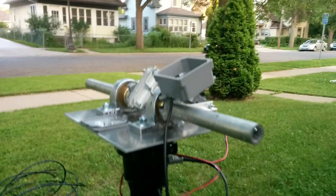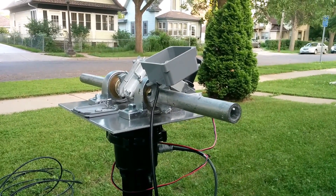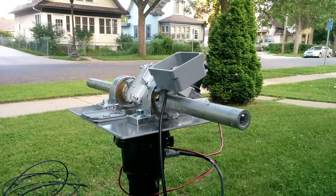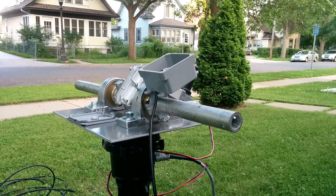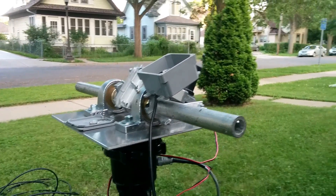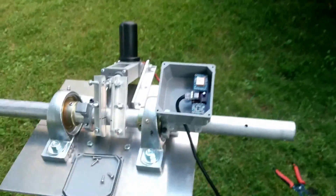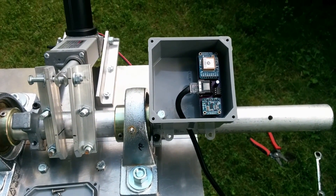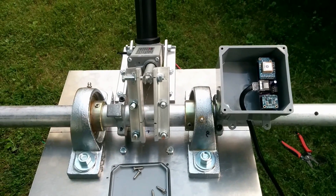It may be hard to see, so I'll pitch it over — you can see we are now rotated to 181 degrees and elevated to 25. Looks like the moon is at 32, so she's continuing to elevate little by little to get the rest of it. I still need to do a lot of tweaking to get the inclinometer set right and have all the proper feedback with the right scaling.